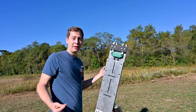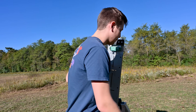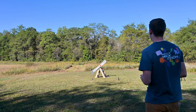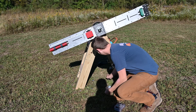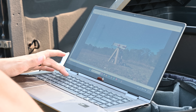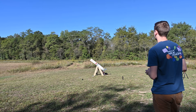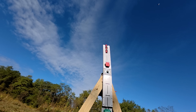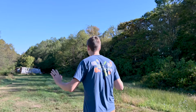We can now send this thing up to max speed and see what happens. It's a lot less scary now that it's sort of balanced — last time at these speeds it was wobbling all over the place. As I pushed the arm faster and faster, I found some other issues: one time it just didn't release until I started slowing down and the rocket literally got turned into mulch. Another test, it was just 180 degrees off for some reason. There was definitely some tweaking, reviewing footage, and making small adjustments to the software, all of which slowly helped. The first really good launch was still at a little bit of an angle, but it was dead straight.